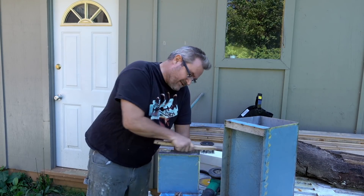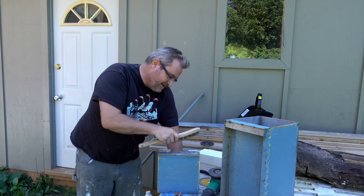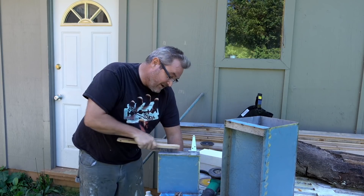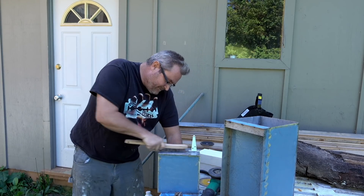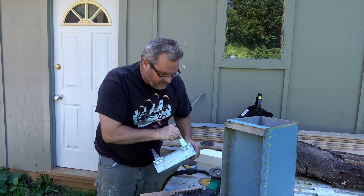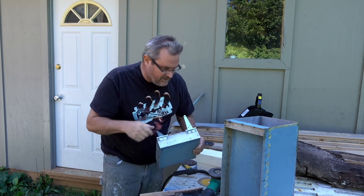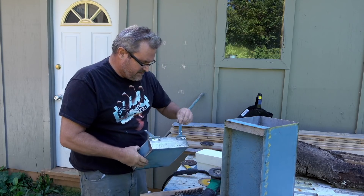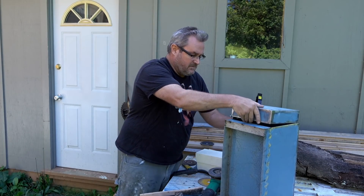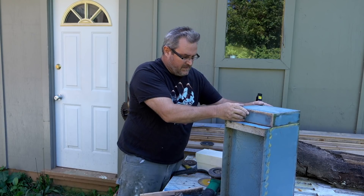This is not decorative. I'm not doing this to show off my welding skills. I just want it to stay together. When you brush it off, it looks pretty good. What I basically did was plug welds — three on that one and two on that one, because two will be enough. And this hinge has gotten a little bit tight, so what I'm going to do now is weld that onto the case as well.